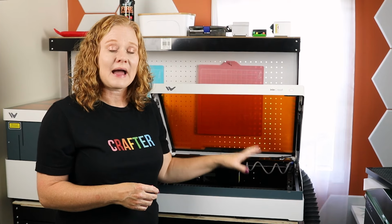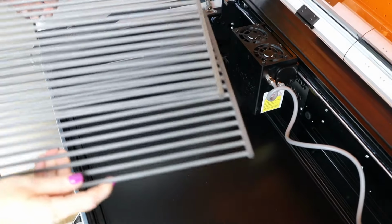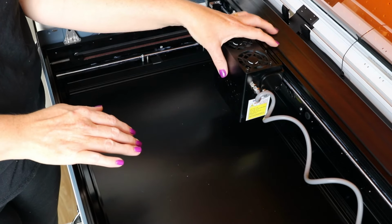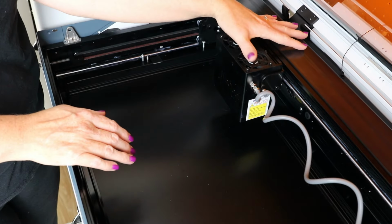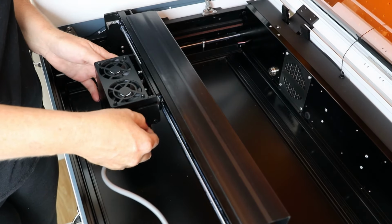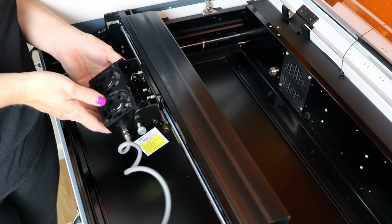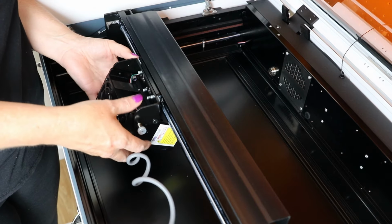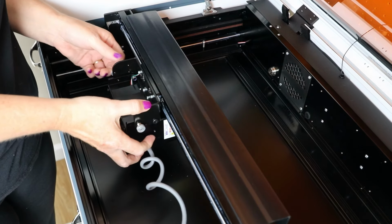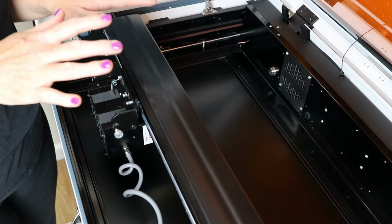So let's take a closer look at the laser head itself, how it is installed in the WeCreat Vista, and how it flips for when you use that rotary tool. Before you get started flipping the laser head, you want to remove the laser beds as well as turn the laser off. First, we'll take a look at flipping the laser head. So if you wanted to do something with the rotary accessory, you would need to flip the laser head. So this is the 10-watt laser head that's installed. To flip it, you'll want to pull it to the front of the machine. Then there are silver thumb screws on both sides, and we're going to loosen those all the way up. And when you loosen them, they'll sort of pop out. And once they've popped out on both sides, I can just rotate the laser head. And the fans are pointing towards me or towards the front of the machine, and the laser is pointed away from me and towards the back of the machine. And then you would just tighten those thumb screws back up on both sides. So the flip laser head will allow you to do things on the rotary accessory in this area without needing to raise the laser up.